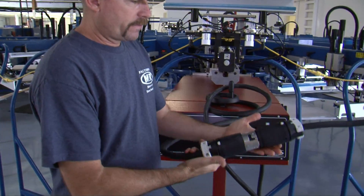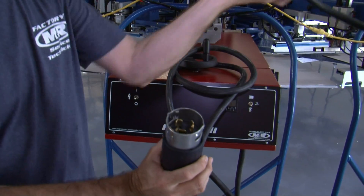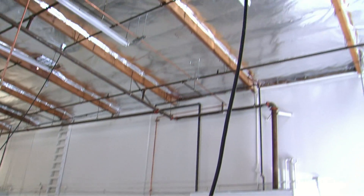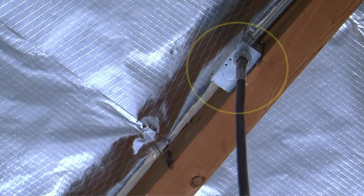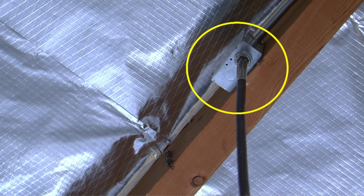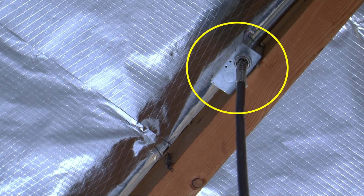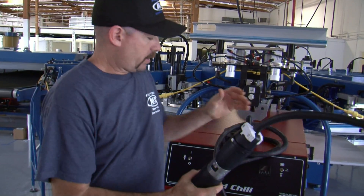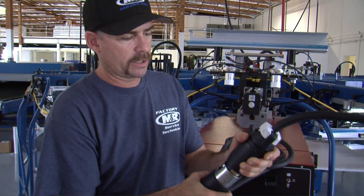The electricians have used 50 amp twist lock plugs to connect this flash. The female drops from the ceiling; the male is connected to the piece of equipment. As you can see, there is a strain relief at the junction box. In case anyone tugged on the cable, it would not pop out from its connection on the ceiling. These plugs are very expensive, but they're well worth the money. They're well-constructed, heavy-duty, and they can take years of plugging and unplugging.